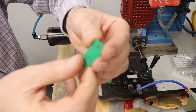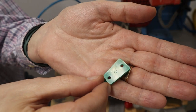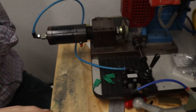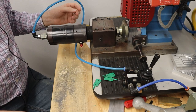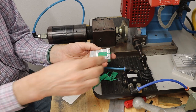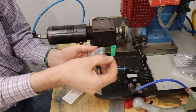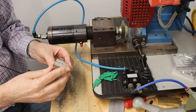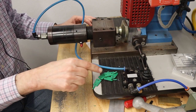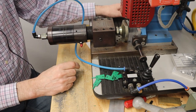By the way, one of the things I did since the last video is I had a little bit of a knob on one side so I can tell which is the top and which is the bottom. This is just a test mold, and it's basically to test the clip mechanism. So there really is no reason it needs to be the shape. It could have been just a straight rectangle, but why not? Now the other thing I'm seeing in here is I'm seeing some streaking, and that's because I have not dried the plastic. I'm basically using mostly what was already in the barrel.